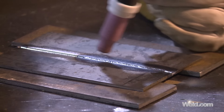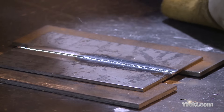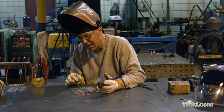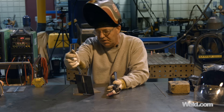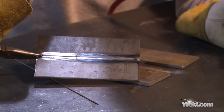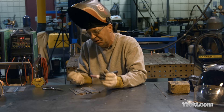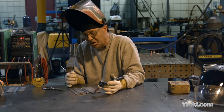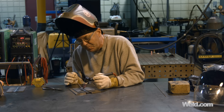I've maintained a root opening, and what I wanted here is for this to be kind of shallow. I'm not trying to get into the edges. I've left them alone to the point where I can go back and put another pass over the top. I still have my original root opening that I started with. I got some good stuff on the backside — we're melted through. It's a little caved in but we're penetrated. I'm going to continue on and add more wire, push that in just a little bit more, increase my amperage, and see if we can get a little better melt through. We created the groove — teaching myself to get proper penetration and leave this alone for a cover pass. Adjusting amperage higher and pushing more wire in.